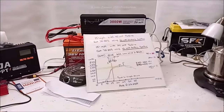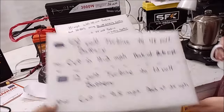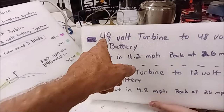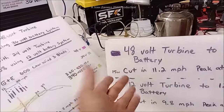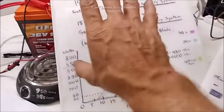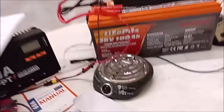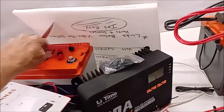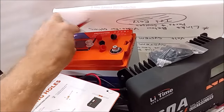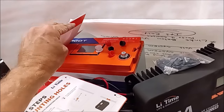Put your questions in the comments. There's a buy-me-a-coffee and Ko-fi link if you want to donate, and I'll answer as many questions as I can. Remember the math - it matters. You're looking at the right turbine for the right battery. If you try to send a 48-volt turbine to a 24-volt battery you'll get about 50 percent, whereas 80 percent is so much better over time. Something we just got is the coolest thing for apartment dwellers - it's the TMGOT battery. If you live in New York, Chicago, Philadelphia, get a couple of these with a charger and an inverter.